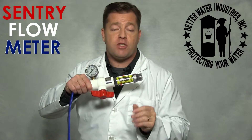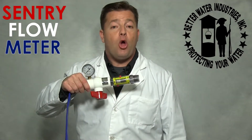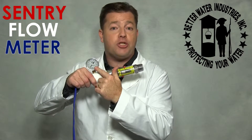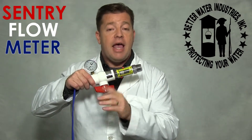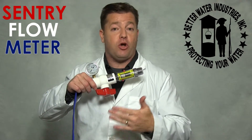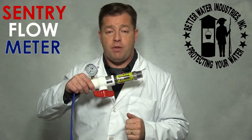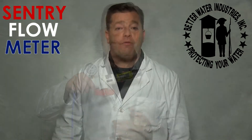That flow rate is your service flow rate and indicates how much water is available for appliances, sprinklers, and water treatment equipment. With the pump running, restrict the flow through the ball valve slightly more until the pressure gauge reads 40 PSI. Then allow water to flow through for one minute and at that moment, record the flow rate. The difference between the 30 PSI service flow rating and this reading taken at 40 PSI indicates the condition of the pump. The variance between the two readings should be less than 25%.